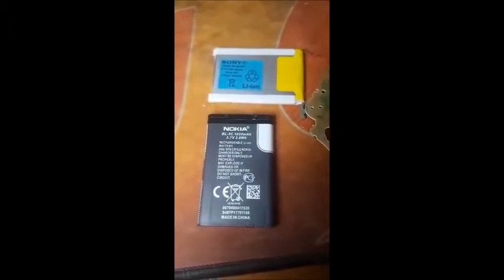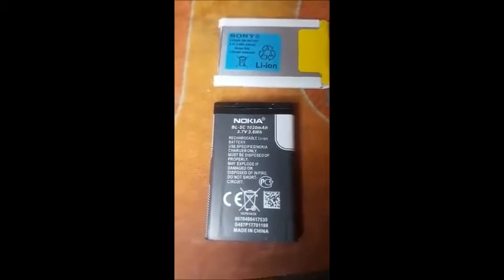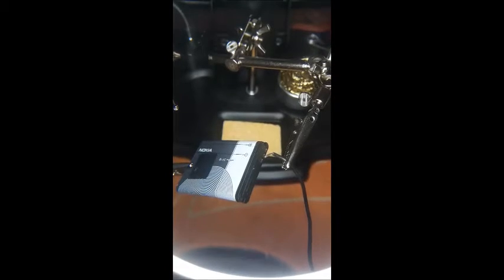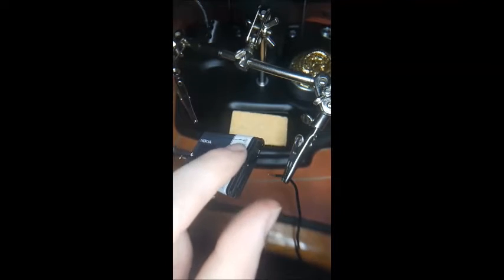Time for a battery upgrade for longer life. The old one is 610mAh, the new one is 1020mAh - almost a 75-80% upgrade. I've got negative and positive - not going to use the middle one. I've tinned both the positive and negative. Pre-tinned the wire as well, with a touch of extra solder on the wire so I can just go dab and she's all done without trying to get this big thing in there.